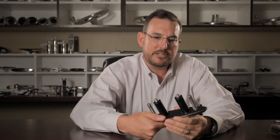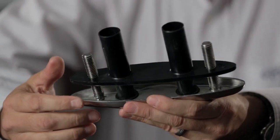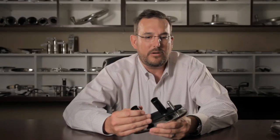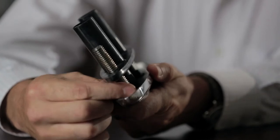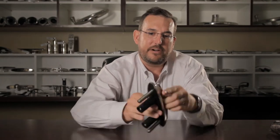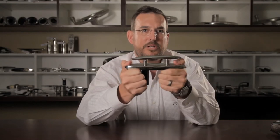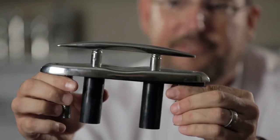This is one of the first Cutting Edge cleats we developed. The first thing you'll notice is the external legs are nylon. Initially a lot of people go, 'How is a cleat going to be strong enough if the legs are made out of nylon?' But all of the strong points are the stainless steel bolt attached to the stainless steel housing, and on the inside the stainless steel cleat legs are all the way attached to the bolt. So we have stainless on stainless for all the strength points. What the nylon does is give us a very smooth cushion to ride up and down, and even if the boat is contoured in shape during the install, because we have the install points at the outside of the cleat, it does not affect the cleat legs itself.